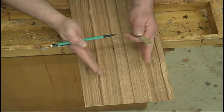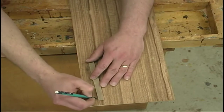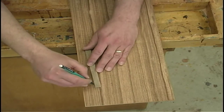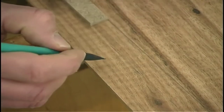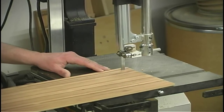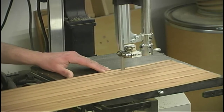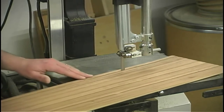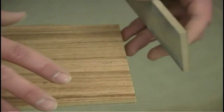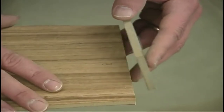The layout lines come along here. Of course we want our panel to be wider, and I've got a little strip of wood here, a half inch wide. I'm going to work along the edge of my line making a series of little marks, then connect all those little dots and I'll have a cut line. Using a bandsaw or even a jigsaw, we can cut away the waste material. I will warn you right away — you're going to have two layout lines at each location. One was the inside edge of our leg, the other was our cut line, so pay close attention to which line you cut. Where the bottom edge of our front panel meets up with the base, it's going to be at an angle, roughly about three degrees, so I want to just back-bevel this a little bit so that the front surface comes down and meets up with the base nice and tight.